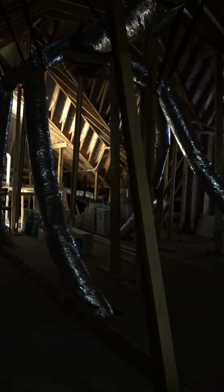We installed the system vertical. Underneath this particular platform, inside that wooden box there's a drain pan underneath there. So if ever that drain clogs up and water overflows, it'll fall into a drain pan, therefore shutting the system off with a float switch on it. Vent pipe runs up through the roof with a cap and collar on it over here.